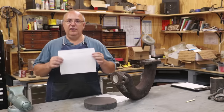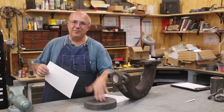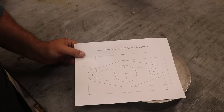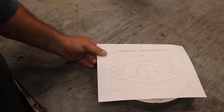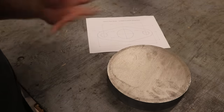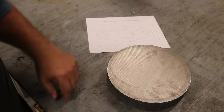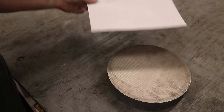That's the game plan. I've got a drawing of the flange that we're going to be working off of. This is basically just a copy of the original — we had some original drawings to base this off of, plus copying what was already on the flange. It's eight and a half inches across from one end to the other. I was able to find this piece of Durabar at McMaster-Carr — nine inches in diameter, an inch and a half thick. I really needed about an inch and a quarter of material, but they only sold it in one inch or inch-and-a-half thicknesses. So we went with the inch and a half — I'd rather have a little extra material than not enough.